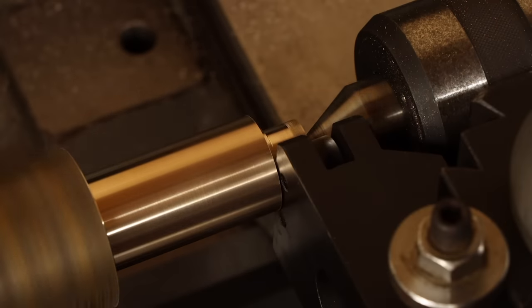Now we can clean up our mess and part this to length. One end of this rod needs a ball feature, so let's make another form tool to do this. Back on the lathe, we can set up for the first cut using the live center for support. I'll have to do this in two passes — first from this angle I'll go just far enough to clear the original OD, then I can reposition closer to the chuck and angle the form tool to cut the remainder of the ball. Even though I said this didn't need to be perfectly spherical, I'm still impressed with how that turned out. Last job on this part is to cut it to length — I'm about 412 thou long, so we'll just turn that offcut into chips.